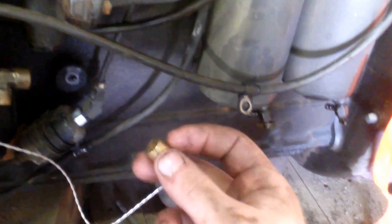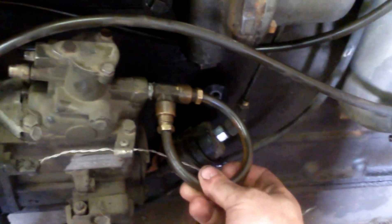Now we have an open hole here that we need to either plug with a quarter-inch pipe plug — I use brass whenever I'm working in a fuel system — or if you're in a pinch and this is a roadside emergency, you can take the fuel jumper line. These are a bit stiff, so it's not the easiest task in the world. Simply loop it and tighten your fittings, and now this half of the FDC is now bypassed.